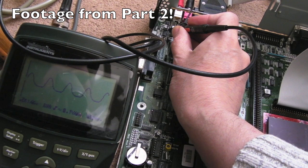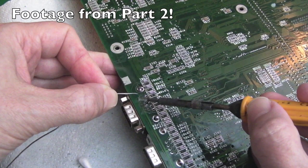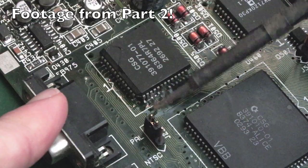Now that could be because someone pointed out there's an additional Butterworth filter on the A4000, and I think it's on the 1200 as well, but I've never noticed it before. It does sound a little bit twangy, but as you'll see in the next video, I've tested all of the connectivity around the audio section. There is nothing faulty there.